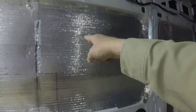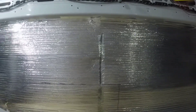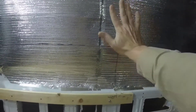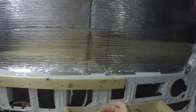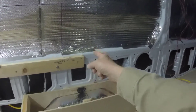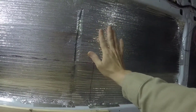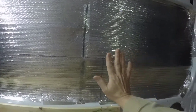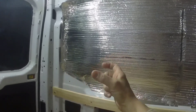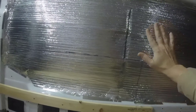Looking straight up you can see the holes up there. The problem — it's not really a problem, just something that needs a solution — is I need to create an inset wall behind the bench that I've drawn on the wall there. That inset wall has to take advantage of that space, so it can't just be straight up. I'm trying to calculate whether I put a two-by-four below here and run that stud all the way to the top, because I need a foundation to mount a wall that's inset a couple of inches.